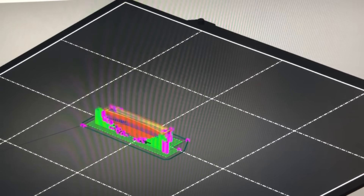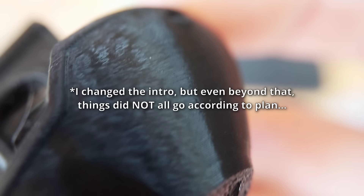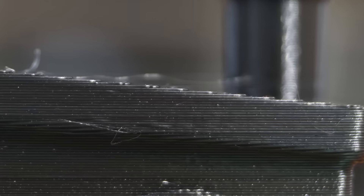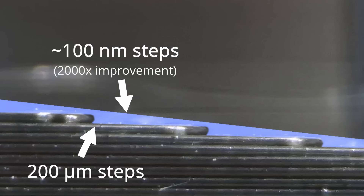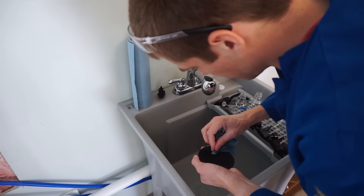Unfortunately for me, wanting to make 3D printed mirrors, a raw 3D printed shape has layer lines. This is a benchy printed at 200 micron layer height, and I want to smooth out the hull and turn that into a mirror. You could remove material with sandpaper, but that still leaves a pretty rough interface, especially in plastic. Instead, I opted to add material that would conform to the layer lines on one side and form an extremely smooth surface on the other all by itself. It may sound like magic, but it's surface tension.